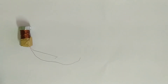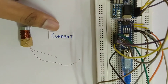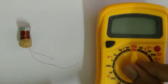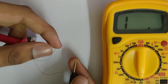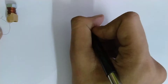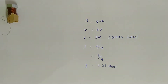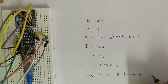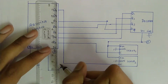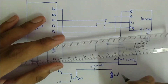But there is a problem — Arduino cannot provide enough current required for the coil. The resistance of this coil is around 4 ohms, so at 5 volts the required current is around 1.25 amps. Arduino can supply only 40 milliamps, which is not enough. To get a higher power supply we can use a relay, so I made small changes to our circuit.